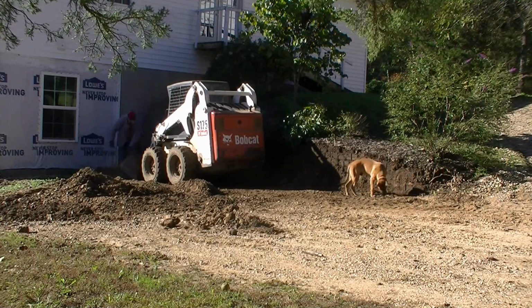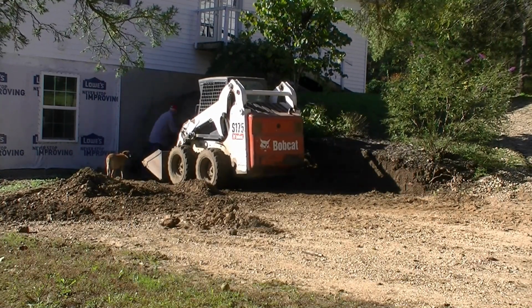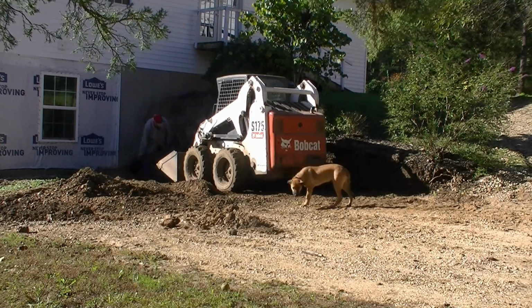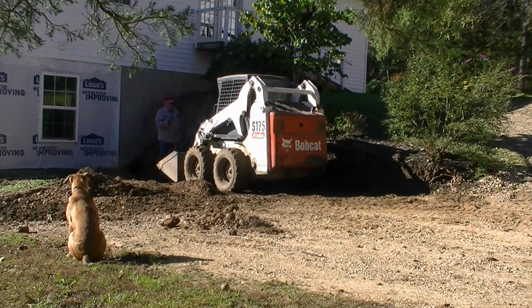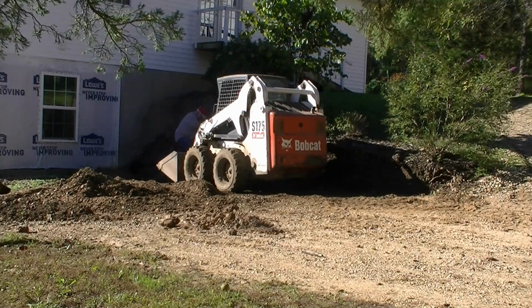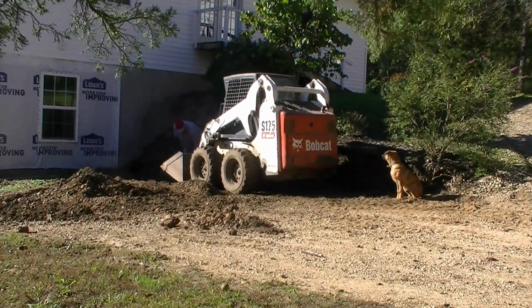It didn't have any drain tile in there before with the crummy blocks that are only supposed to be stacked 4 feet high, and I had them stacked close to 8 feet high. So, it lasted a long time. I am pretty sure this will last forever. I'm going to make sure I get the good foundation going on these big blocks, and you'll see how it goes.